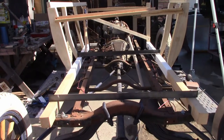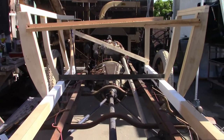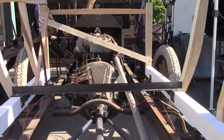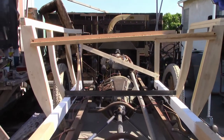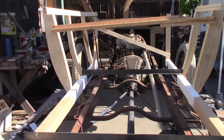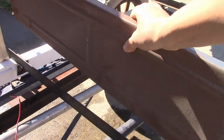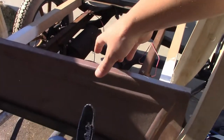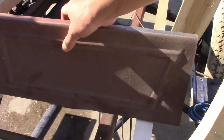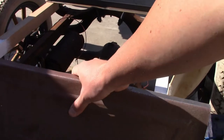It's all back together. I've got the posts back on. While I was putting it together, I discovered that the frame I'm working on is actually twisted a little bit, so I had to put a bunch of shims on the right front corner. I had to remove the fuel tank to measure it, but anyway, that's fixed. The next thing I'm going to do is work on the seat riser. The brace I made here is just held in with drywall screws right now because it's temporary — I'm going to relocate it to just behind the seat riser and then probably weld them together.